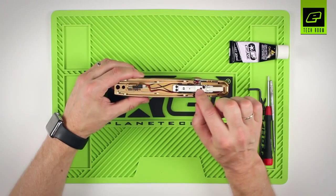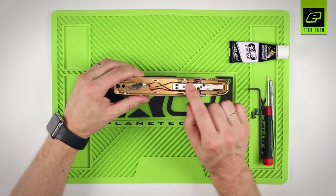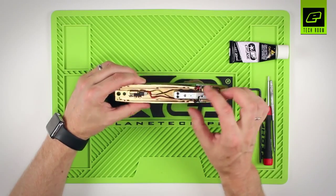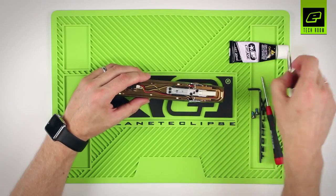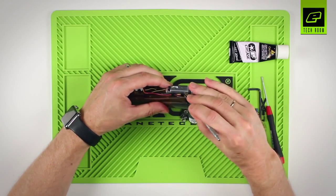If you're going to disassemble the solenoid assembly further than just simply greasing the spool inside here, you'll first need to remove the wiring from behind the clips to allow access to the manifold, allow the manifold to be lifted off and the gaskets inspected.